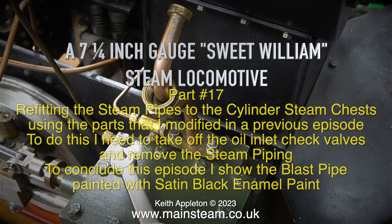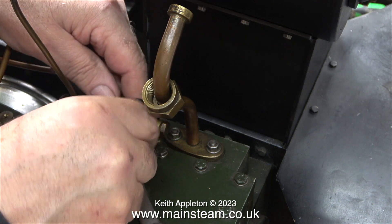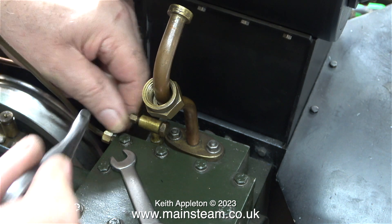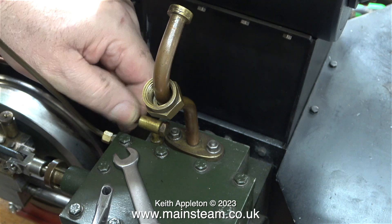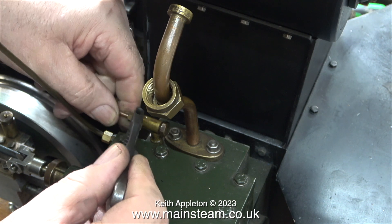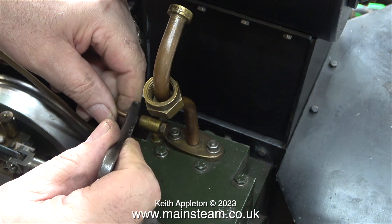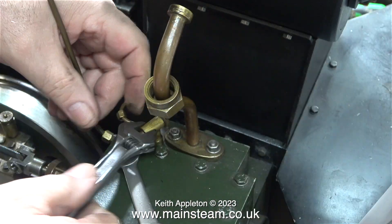You may be puzzling why I'm doing it this way - surely the easiest way is to fit the steam unions to the smoke box and sit the entire thing in position. On an almost daily basis when I rush into the workshop I've already thought out the way I'm going to do the job and, more importantly, the reason for doing it this way. The two BA nuts that hold the steam pipe flange in place are very poor quality - I want to replace them with extremely good quality machined two BA nuts.